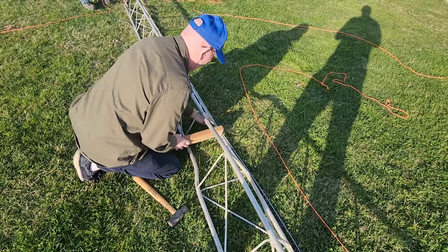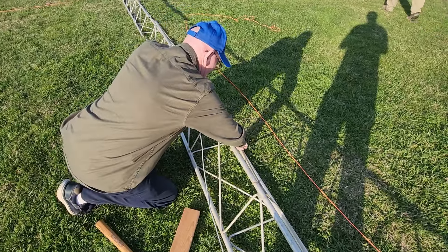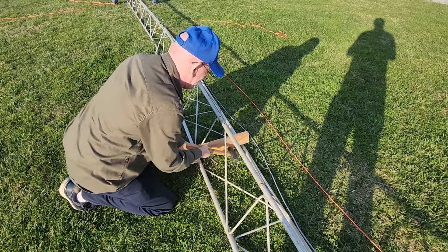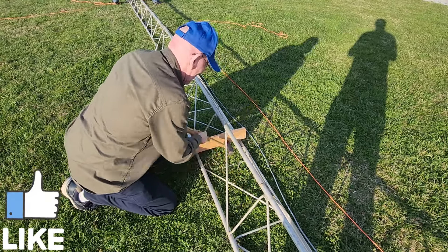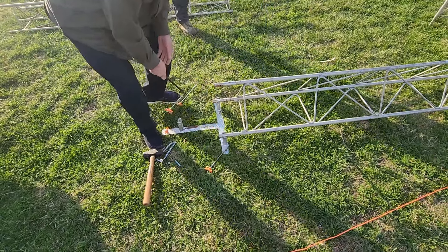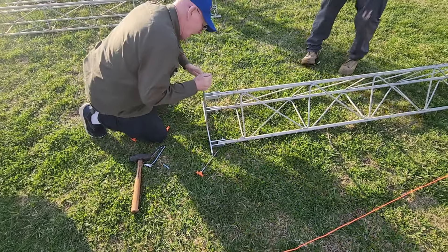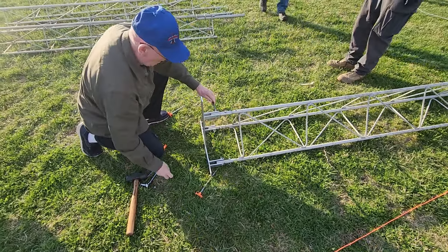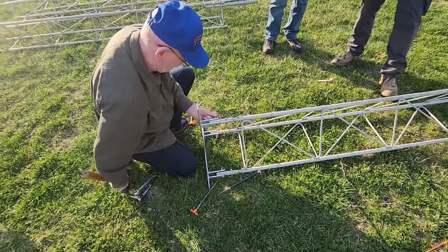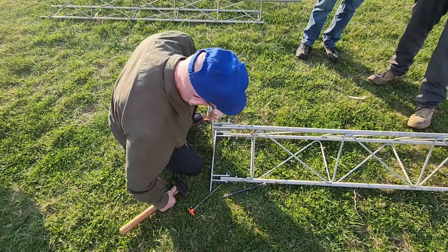Each year we've gotten a little bit better at what we need to run the race for communications, and our race organizers appreciate all of it — because without the communications, they can't race at all. We still have a problem over in Zone 2 where crossband repeater number four goes. Since we've moved net control, we can't quite hit it from crossband repeater number four, which means we're thinking we'll have to find yet another ridge and do a little billy goat mountain climbing. These types of projects are a lot of fun — get a lot of your members involved — and it's to inspire clubs to look for races, walks, and runs that you can provide communications for, because if you do it year over year, you'll get better at it and come up with better ideas.